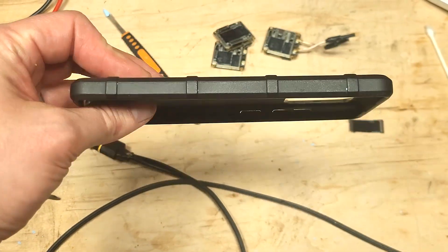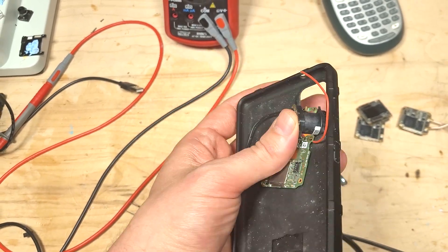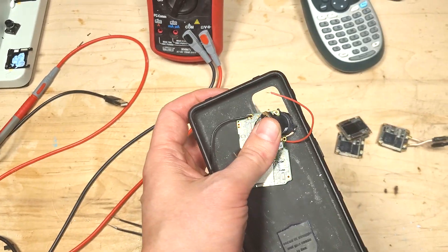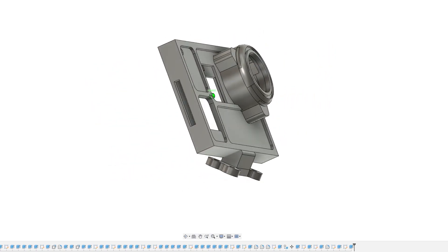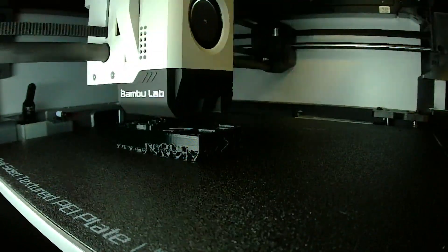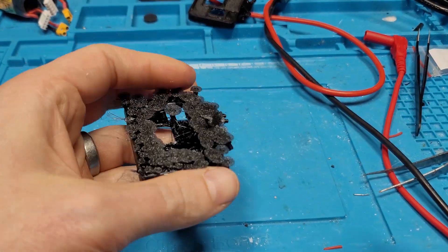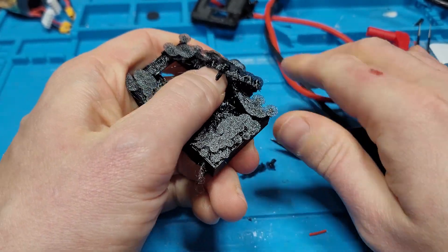After some design thinking, I took inspiration from a screwless protective case I carry in my pocket, and decided that a phone case design with the back being left open would be how I would move forward. I worked on the GoPro 8 case, which wasn't terribly difficult due to the compact lens compared to the 7, and after a few test iterations I had a design I was happy with. Printing as one piece is slightly challenging, but I found that using tree supports worked best and wasn't horrible to remove.